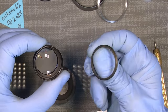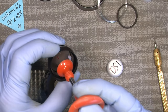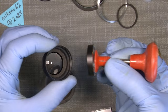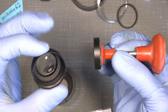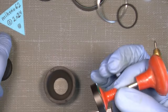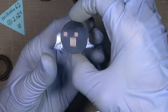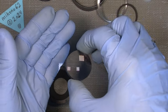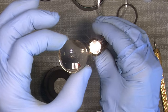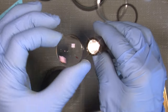And this ring looks also fine, no problem. So I can take out the very back lens element, which is also the most fungus. So there, wow, nice element. And there is fungus in here. You probably can see there's a dot there. But it's more on the very back. There is some serious fungus here. Let's have a torch. Oh yeah, it's also a little dirty, but of course it doesn't really matter. I think we can make it.